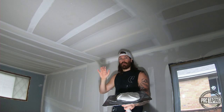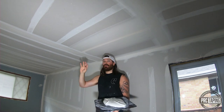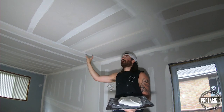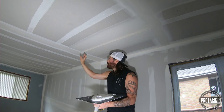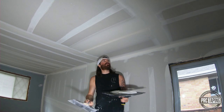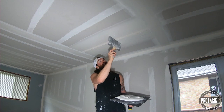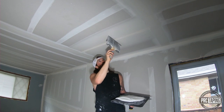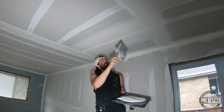What I'm going to do now is fill the middle by hand, and then tie in the sides without cutting into the flat joints that are already setting up. I'm going to run my mud right down the middle with my 10-inch knife, then fill the edges and float it all out. This is actually the worst butt joint in the house, so it's kind of perfect. If you put your knife over top of this and set it right on the tape, there shouldn't be any movement — you should see it cut into the mud on each side, which means all you need to do is fill the middle and flare the edges.